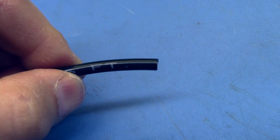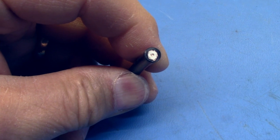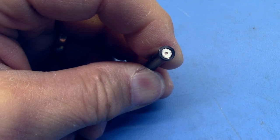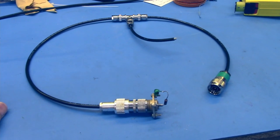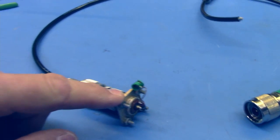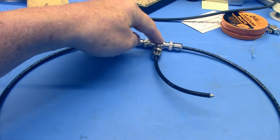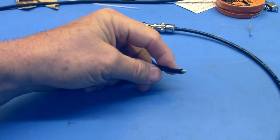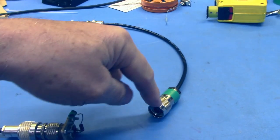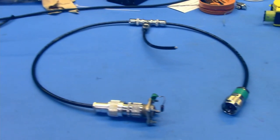With an open stub it's a lot easier, you just clip off the end, but carefully inspect the end of your coax to make sure that there aren't any little hairs of shield shorting in between the two. So the completed stub match, including the perfectly awful load that we have here, through the admittance transforming coax to the T, here is our shorted stub, and then this is just a piece of coax to a termination so I can connect it up to my vector network analyzer and see how it performs.